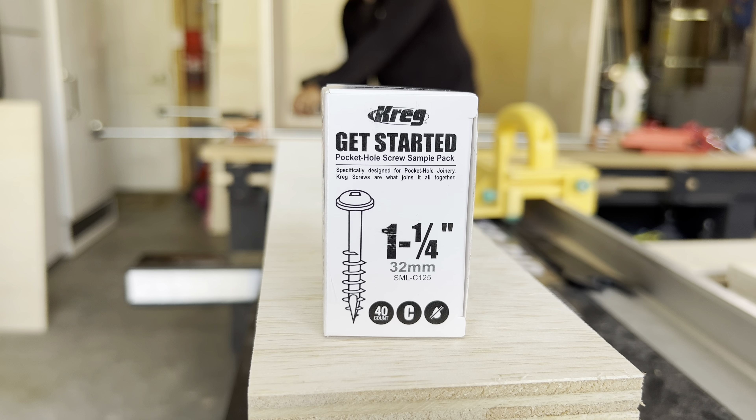Now we've got our MDF cut for the top of our cabinet and we're going to focus on laying out where we want to get our T-track put in. I'm using three pieces here — I got this one off Amazon and the color is really cool; I'll leave a link in the description. We're going to use it as a straight edge up against our saw fence, with two more pieces representing the gap I want between the fence and the T-track. I actually want the T-track set back behind where the material is going to go. Instead of using a router to cut a groove in this top, the MDF top will actually be in two pieces — a piece, then the T-track, and then another piece in front.